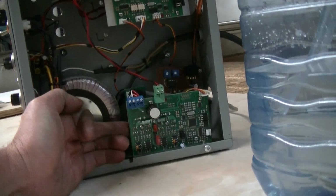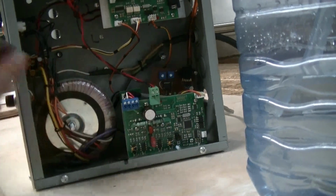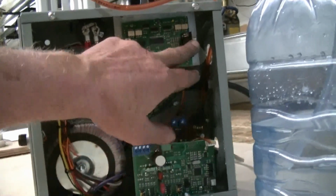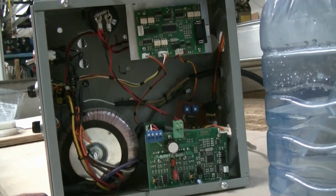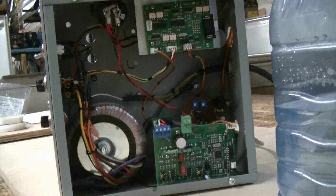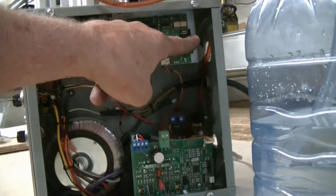But this drive is running at 2,000 counts per rev, and the step and direction comes between here and here, off the controller into here, and here I've got the analog inputs for the dials, the two dials, power, and it can also data log out to a laptop, displaying continuous pressure and time. So that'll be something that's an accessory. You don't have to use it. It doesn't have to connect to the laptop.